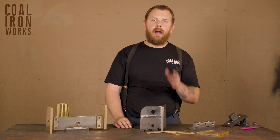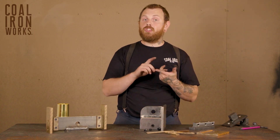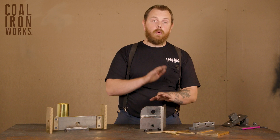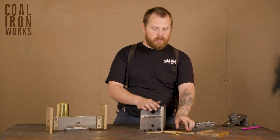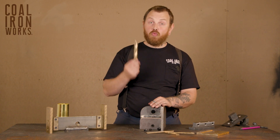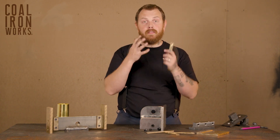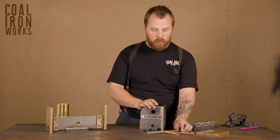These are made out of 954 aluminum bronze, and we use that material because it's extremely strong and it wears really smoothly when put against a steel slide assembly. However, it also needs to be 954 aluminum bronze specifically. If you make this out of a softer material, it's going to degrade really, really quickly and potentially even deposit itself on the surface of the slide assembly on your forging press. So that's why we use the 954 aluminum bronze.